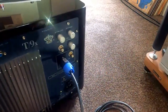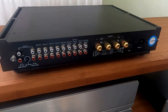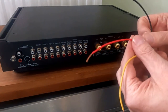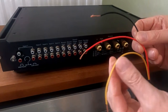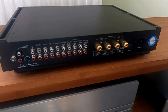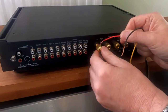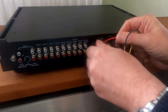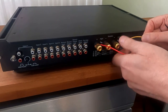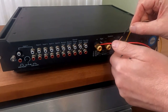What you do with that is — on the back of the amplifier, these are your speaker outputs. We have the other end of the Neutrik high level lead with three wires: red positive (right positive), left positive, and then a spare earth cable. You take your right positive, put it into the right positive on the binding post, and then your left positive which on this one is over here. Your spare earth just goes to either terminal — it doesn't matter because it'll go to ground anyway.